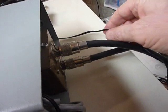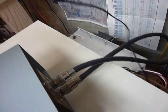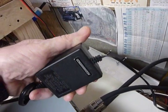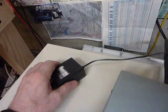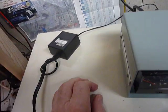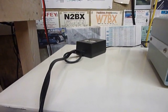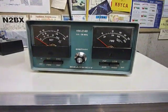I've got it right here in this setup. What I wanted to show you is I have a little 9-volt battery clip in there, clipped into where the 9-volt battery goes, and then I've got a 9-volt battery eliminator right here. This one has a transformer in it. I pick these up at Goodwill or garage sales — I've got three or four of them. I look for the heavier ones because those have a power transformer inside. If you pick one up and it's really light, it's got a switching power supply, and a lot of those are noise generators — you don't want a noise generator on your ham radio rig.